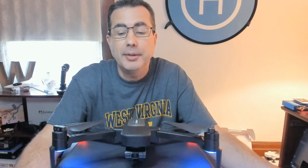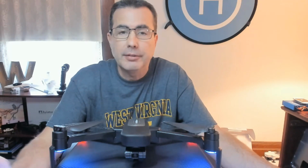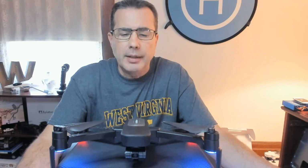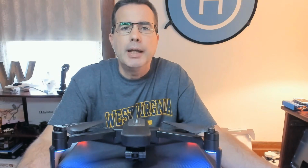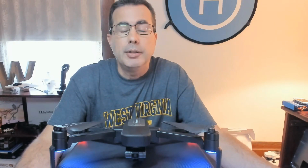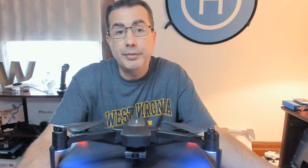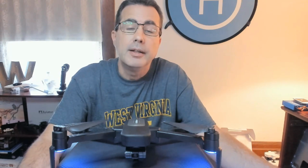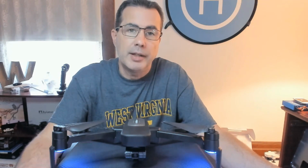One this time. I'm not lying to you. We're just going to do a quick, simple fix for gimbal error 0X0004. And usually when you get this, it's a gimbal calibration error code, and you're told to go in and calibrate the gimbal within the app. And then after you do that calibration, it tells you to restart the quad. And then when you restart the quad, you go into your gimbal and check the status, and you still have the status error 0X0004. So a majority of the time, here's how you fix it.